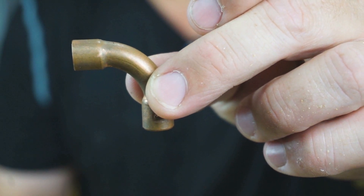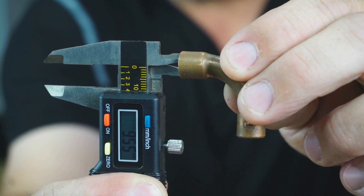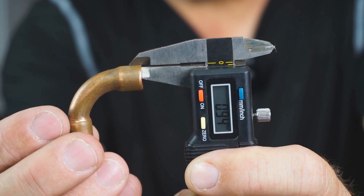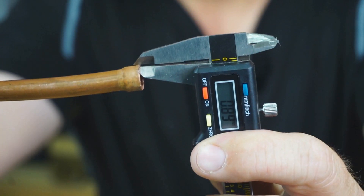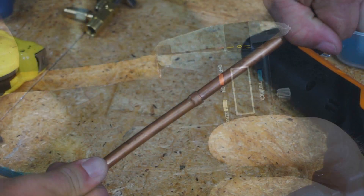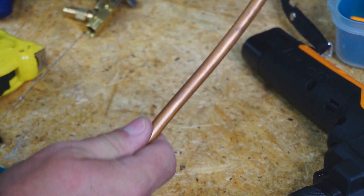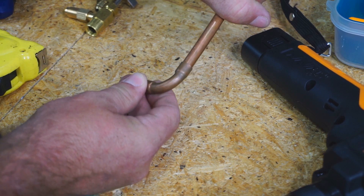Let's compare with an actual 3/8 elbow to see what the inside diameter is. The inside diameter of the elbow is 9.55, which is very close to what the expander made. The expander was a little bit larger in one orientation and right about the same in the other. The width of the copper in the factory-made elbow at the bell end is 0.94 millimeters. The width of the expanded copper at the bell end is 0.89, just slightly less than the factory. The copper fits together tightly — not very loose, just a slight amount of play. Trying the factory elbow now — slightly less play, maybe. Pretty similar, actually. I think that's a successful expansion.